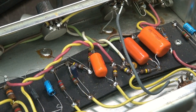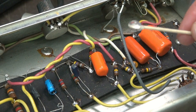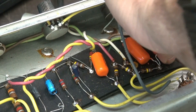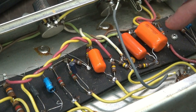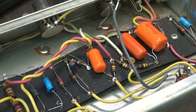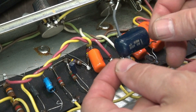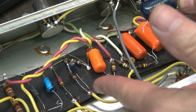I've changed all three caps with some Spragues. When I'm done, I take a little bit of adhesive and put that underneath the cap — glue it down to the eyelet board to help support that weight. The reason these leads usually fail is from vibration. You envision the weight of this cap suspended on the board, moving around. Where's it going to fail? Where the leads are going into the cap. So I always glue these down.